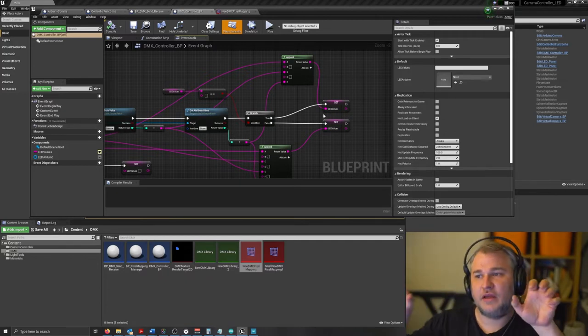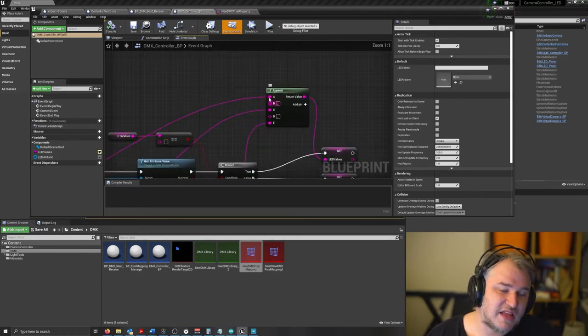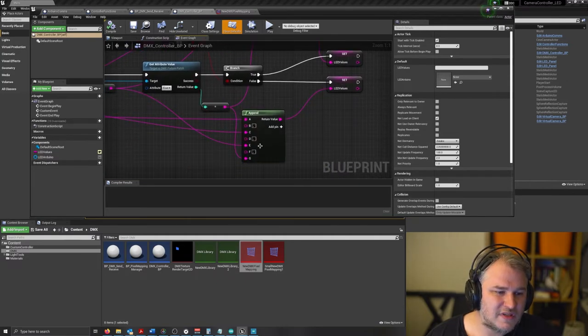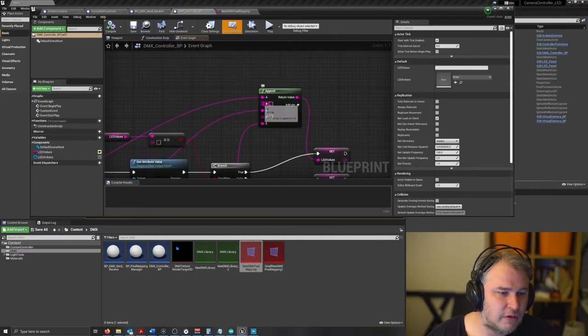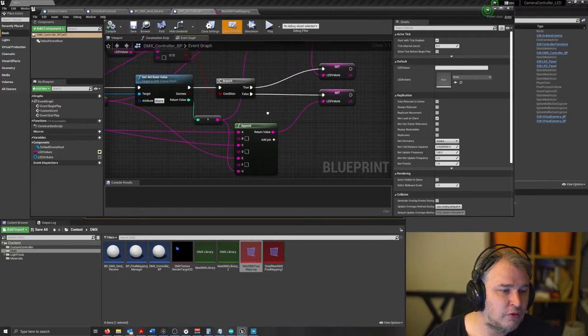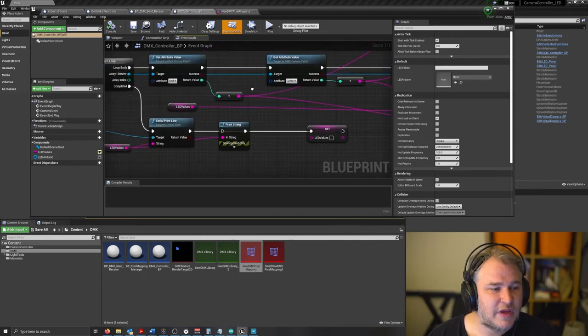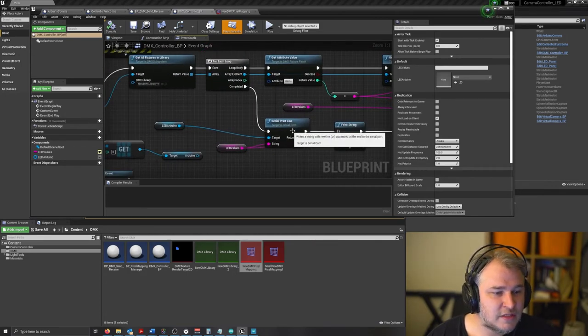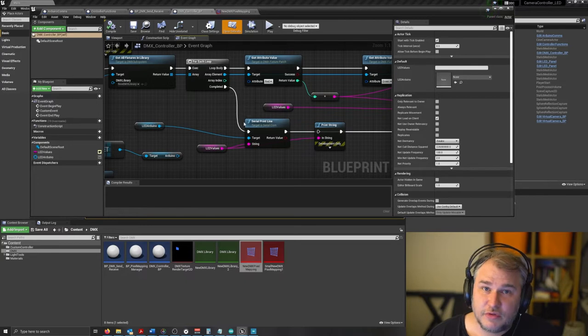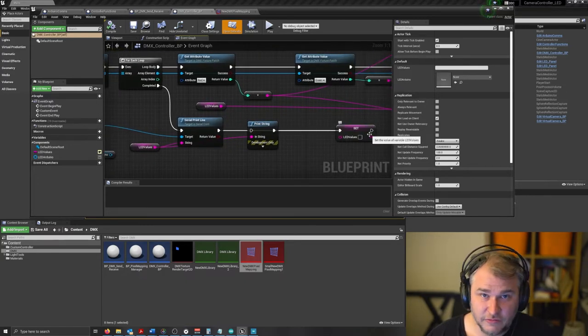So it's constantly appending a string to a CSV, essentially. The first one comes up, and if it doesn't have any strings in there, it reads it, checks it, and then it doesn't start with a comma or end with a comma. So red, green, blue, and then it'll take that current value and then comma, red, comma, green, comma, blue, and then do the same thing, current value, red, green, blue. Once it reaches the max of the loop, it completes, it reads the string, it prints it out to the serial port, and then it clears it off for the next line.